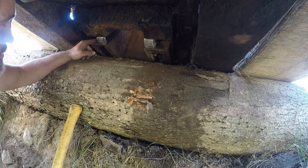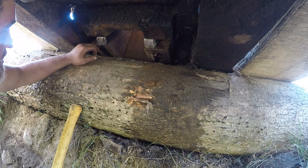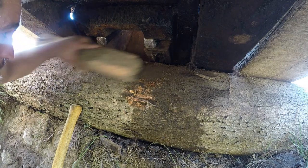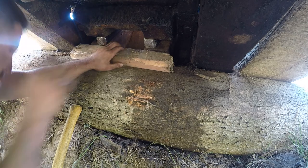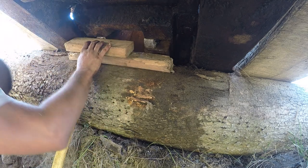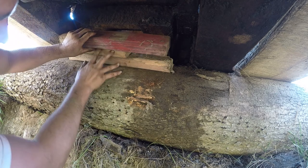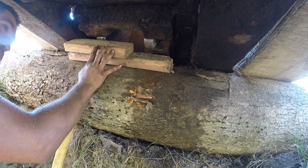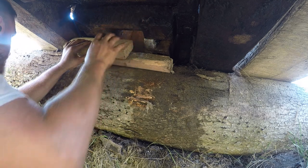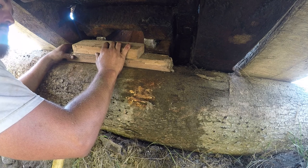Here's my mat right now. I drove the wedges back in down at the bottom — this is right where I want this to be, back to my inch and a half tolerance. The plan is I just need them to not fall out. I've got some 2x4s and I'm going to stack them up, screw that one in and then this one on top, and do one more. That'll just keep them from falling out. This jaw plate is the part that moves, but this part down here shouldn't be moving. I'll screw these in and run it and see what it looks like.